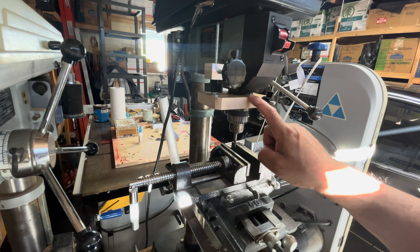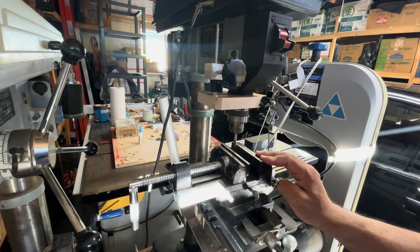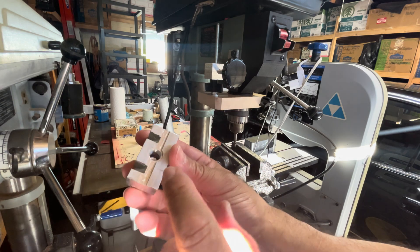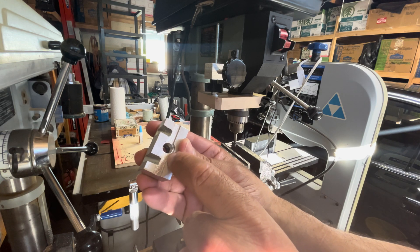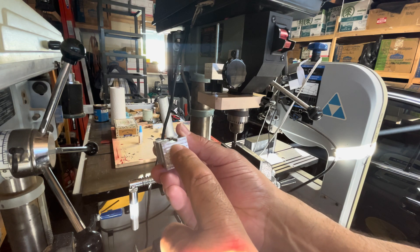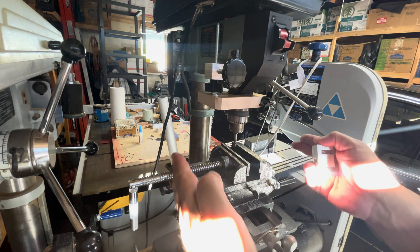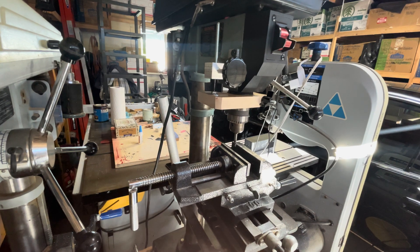Without this, when I was milling a piece of soft metal like aluminum on the drill press — this is one inch by one inch, two inches long — this center channel was supposed to be six millimeters wide, but by the time I got to the actual depth it was over seven millimeters. Every time I would loosen the handle on the back and raise the base plate up, it would twist just a little bit. So if I keep the base plate locked in place...